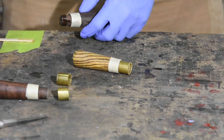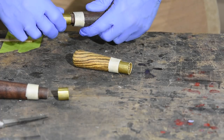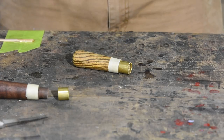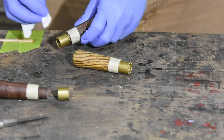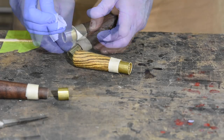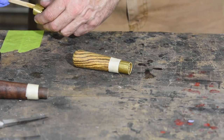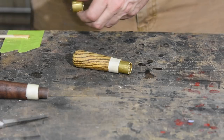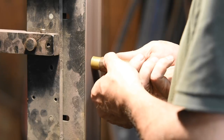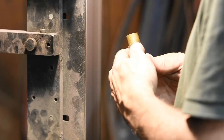Next, I'll secure the ferrules using epoxy. Some people will knock a little divot in the side to form a sort of detent that locks the ferrule in, and other people run pins through them. This makes good sense for tools like chisels that have a slip fit into the handle, but for tools like files, which have tapered tangs, this seems to me unnecessary. Pressure from the tang of the tool will radiate outward as it's jammed into the handle, creating plenty of force to keep the ferrule tight and in place over time. I cut the ferrules oversized, leaving them proud of the surface, so after the epoxy is set, I'll grind off the excess tube, chamfer the end a little for comfort, then polish up the brass.